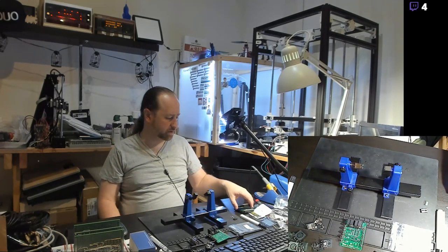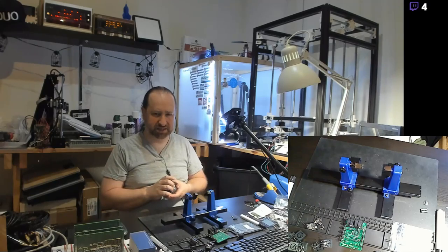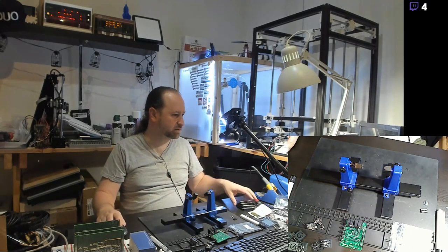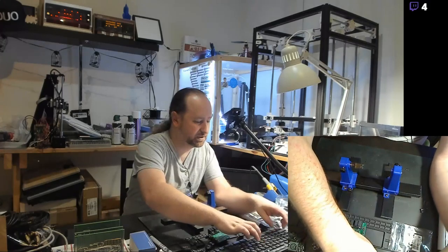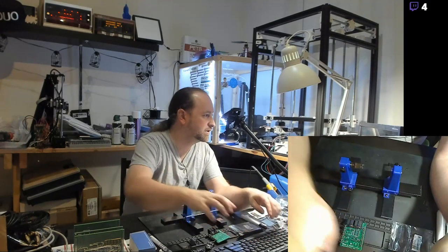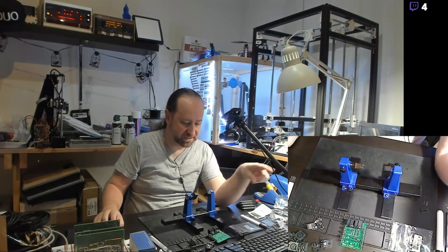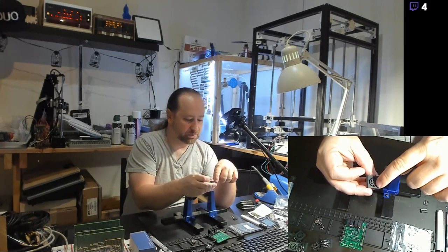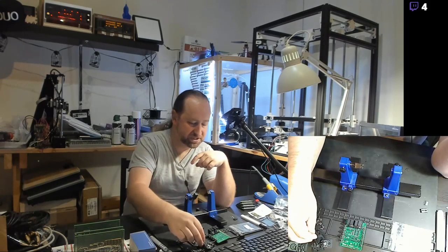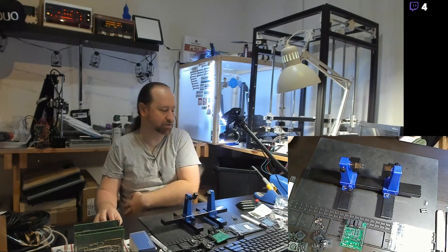There was an older keyboard port. Is that the IBM XT-AT ports, Eddie? Let's see, IBM XT keyboard. Oh yeah. The XT keyboard connectors were 5-pin DIN. They were just like these, but 5-pin. They didn't have the center pin, and it was wrapped tighter around the bottom for all 5 pins, which is actually similar to the 8-pin. Yeah, I had one of those for such a long time.